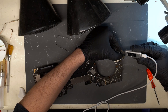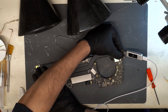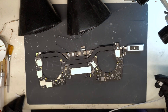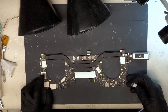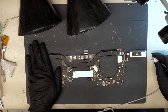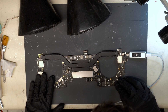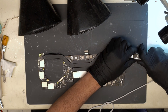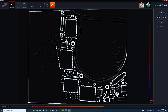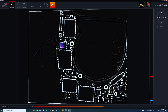So we're charging at 5 volts. Looks like we have some kind of short — we're not getting our 20 volts, and it seems like it's pulling 0.25 amps right away, and I think it's getting warm on this side. So we have some kind of short on this side of the board. I'm gonna grab the thermal camera. We can see our CD3215 chip is lighting up as soon as we plug in power, so it's got a short somewhere there.